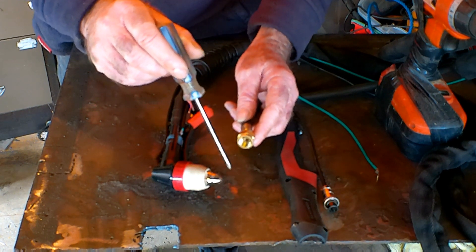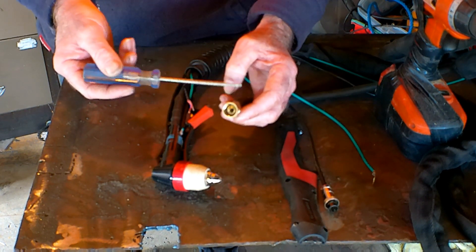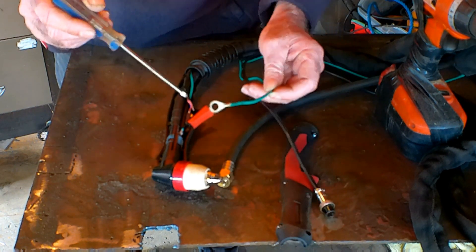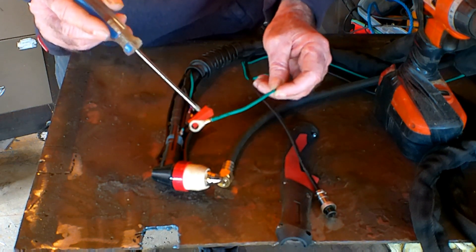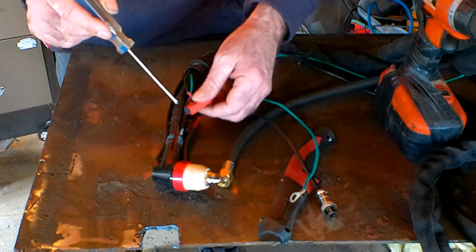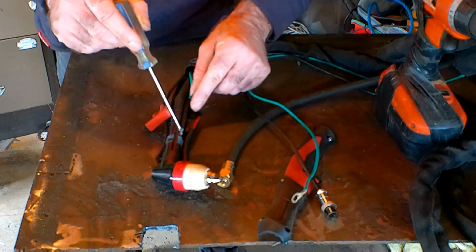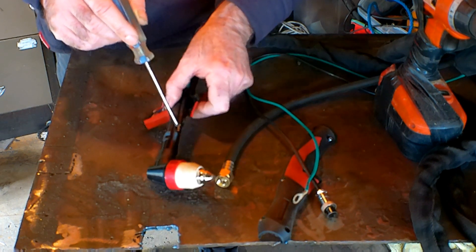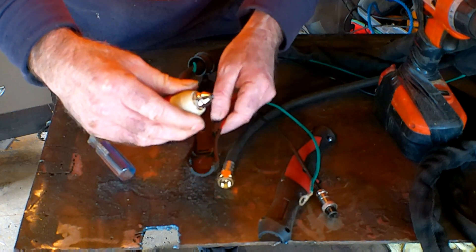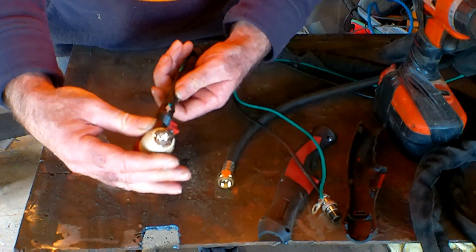So you get the air blowing out of your nozzle - but there's a trick to these air hoses, I'll show you in a minute. Then this wire here, which is the extra pilot arc wire, goes down there and up here. If we pull the switch out, it gets soldered in here - can you see that? I'll pull that out so you can see it.